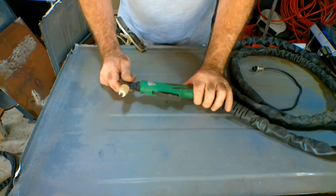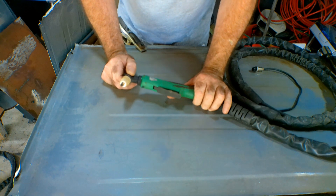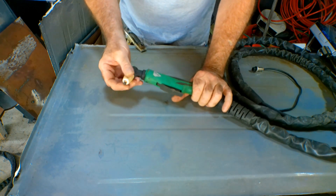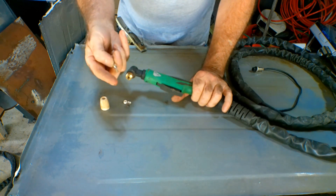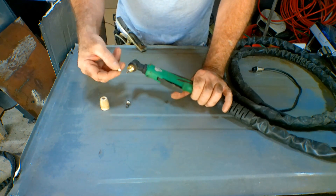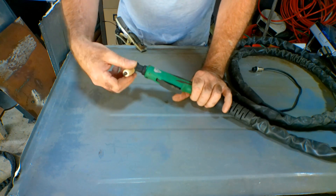The torch I'd recommend if you're using a 40 amp or 50 amp plasma cutter — any one of those cheap Chinese ones, which is what I use anyway — is the PT-31. That's because the consumables are really, really cheap; they're the cheapest consumables you can basically get. The electrodes are interchangeable — you can swap them over, reverse them from one side to the other. You burn one side out, you just turn it over. It's just a cheap form of plasma cutting.